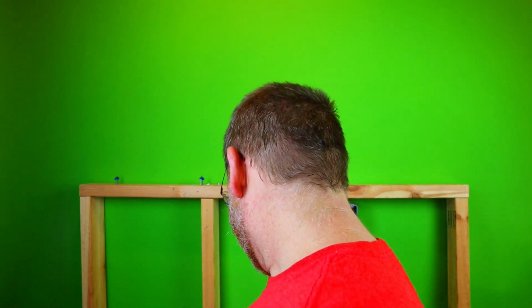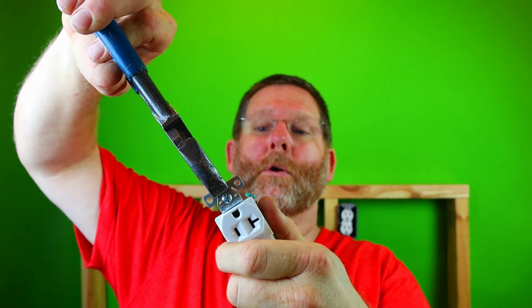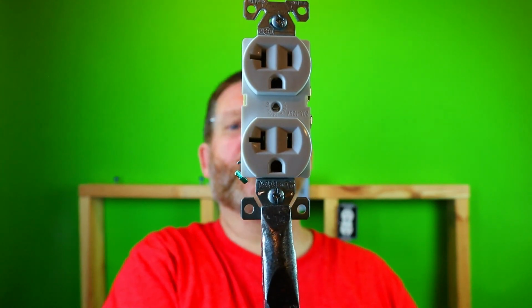The best way to get rid of that is you can take the screws out, which I'm not going to do, but you see where the perforation is along the top? Just take your Kleins right there. So it looks something like that. Or your Leathermans or whatever you got. And just bend it back and forth and you'll get the ears and everything off in one shot.